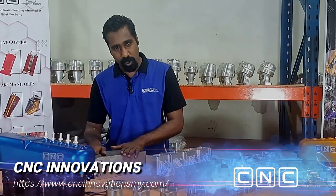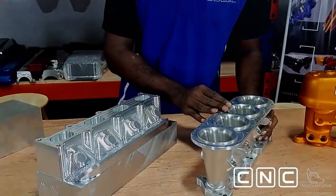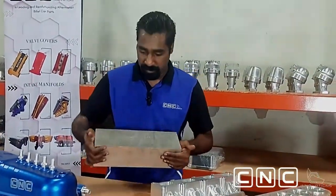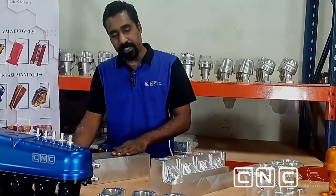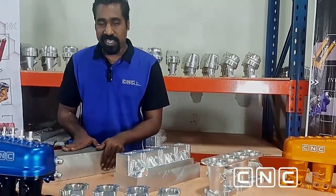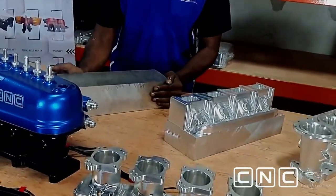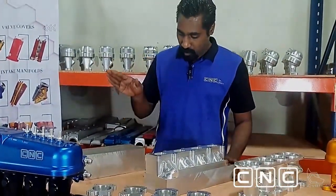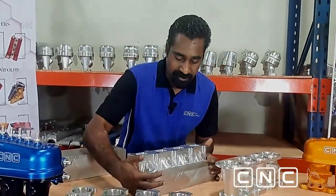So what we have here is the raw material, the semi-finished product, and the finished product. For this piece — it is quite heavy, I wonder how Anna carried it earlier. This is aluminium 6061. That's grade 6061, and it's also T6 — T stands for tempering. What they did was they tempered this aluminium block so that it becomes stronger and more resistant. So this is the aluminium we use.